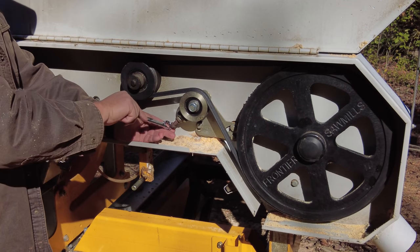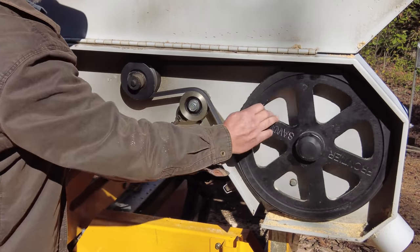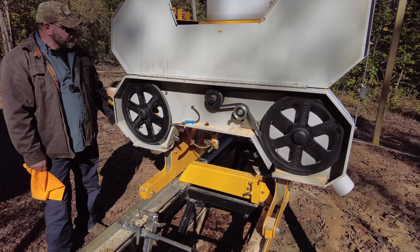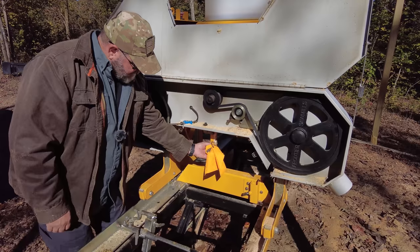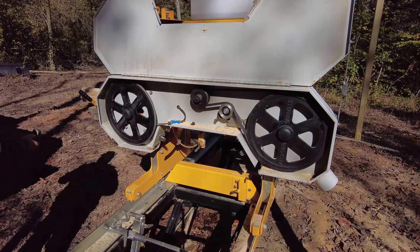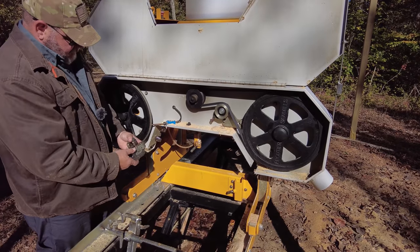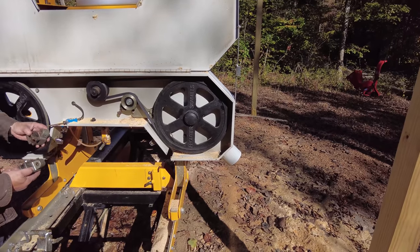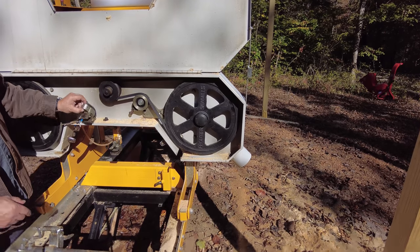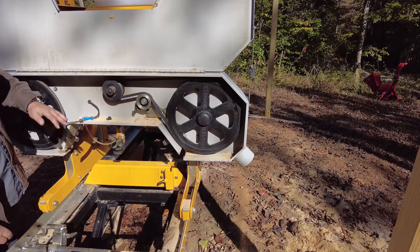That belt needs to have enough tension on it that it's not flopping around, because it'll cause the blade to come loose — we've already established that. I feel pretty good about that part. Now I'm just going to put this all together. The next thing is to go ahead and put the blade guide back on — it's got brand new idlers. I really wished I had paid attention to which one came from where. I don't see that's a big deal; they're exactly the same in every way. We'll go ahead and hope for the best. I think these are actually the right ones because this one over here was a little difficult to get on.